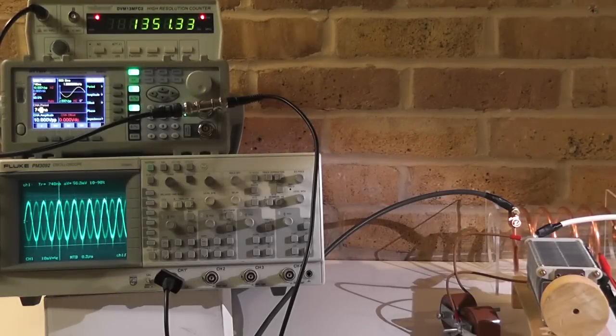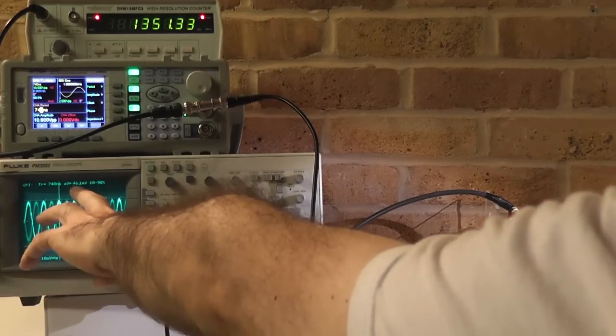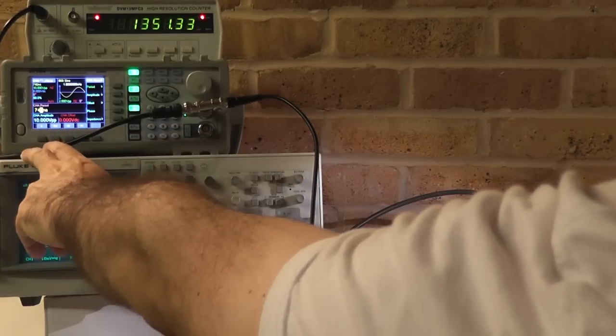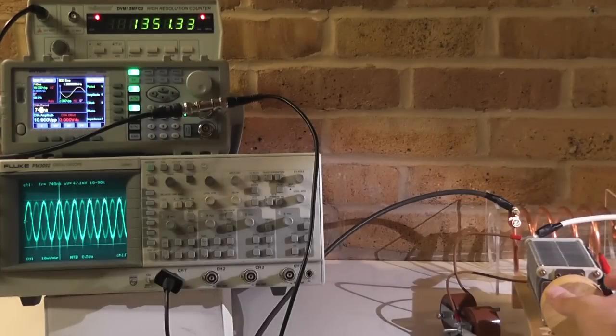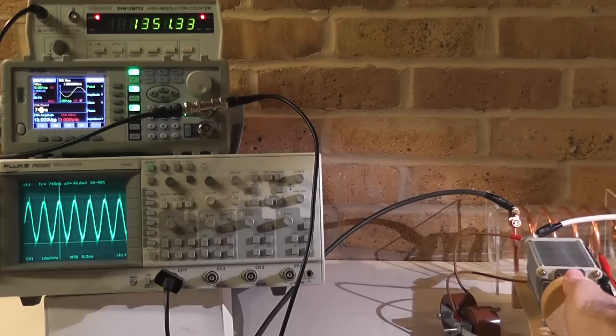The system is now in resonance at 1.35 MHz. I did a sweep but changed it to nanosecond periods — it's easy to see because the voltage changes and tells me 740 nanoseconds, which is confirmed on my digital function generator. I also chose to connect my frequency counter. A slight change in the capacitance trimmer has a tremendous impact on performance in the picofarad area. That's a very nice, very good peak.